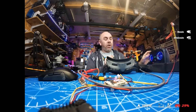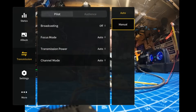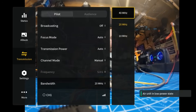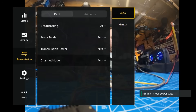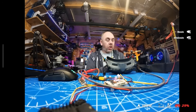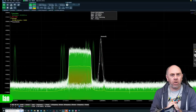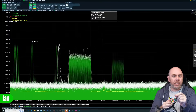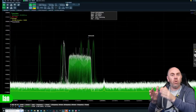What doesn't work unfortunately is setting it at 40 megahertz and going back to auto — it drops back down to the 20 megahertz carrier and 32 megabits a second. I have confirmed all of this on my spectrum analyzer. What is happening is it is sticking on either 10 or 20 megahertz bandwidth; it is not jumping to the 40 megahertz bandwidth when using auto with the Goggles 2.